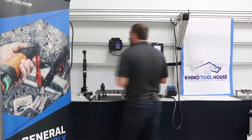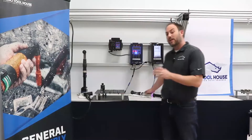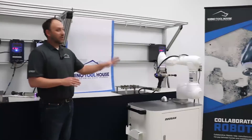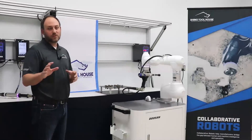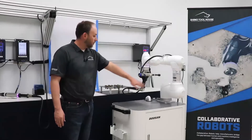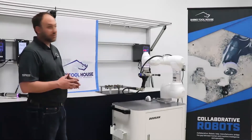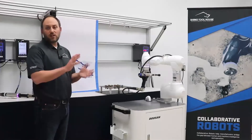One of the things we've been working on is our cobot. The intermittent fastening and reduced reaction led not only to benefits for operators, but benefits for autonomous and automated situations. We've put the high speed 30 Newton meter pistol tool mounted to our Doosan collaborative robot. Collaborative robots have a limit on how much torque reaction they can absorb, creating a need for a tool with limited reaction. We're using a right angle adapter, an end-of-arm tool, and 24 volt IO to communicate directly from the robot to the tool, with a floating spindle on the end for play when tightening the bolt.